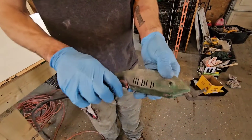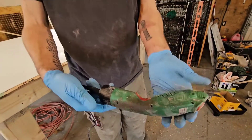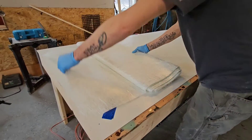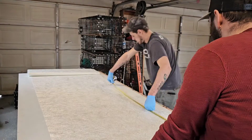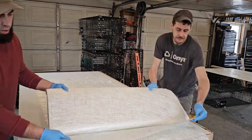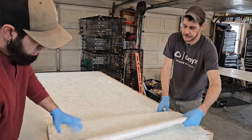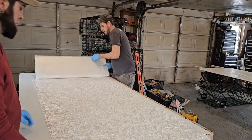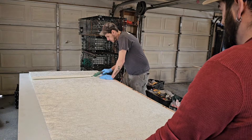Now we're going to use the electric scissors to cut some glass. This makes it a lot easier to cut this up into manageable sizes so you can maneuver it better. We lay the fiberglass out on the K-lite, measure it out, make sure we have the right size — a little extra, not less. Once we get the first one cut, we just keep doing this multiple times until we get all of them cut. It is repetitive, but it has to get done to get enough material ready to actually start making the tank.